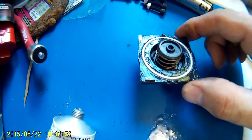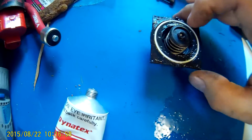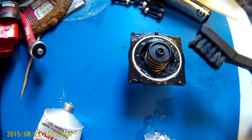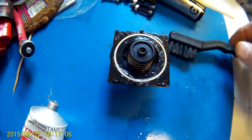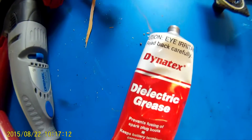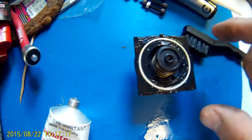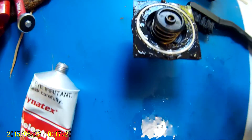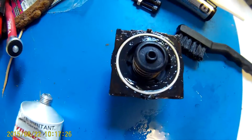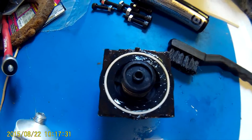Here it is all cleaned up and put back together — cleaned up real nice. There was some surface rust on the plastic, so no big deal. I used a soft bristle brush, then got some dielectric grease and put it all over the mating surface, coated it, and this part is done. Now I'm going underneath the car to get that surface cleaned up and hopefully rust-free.